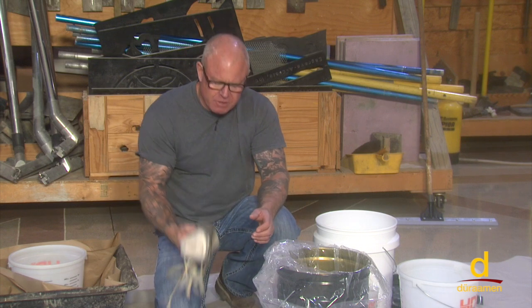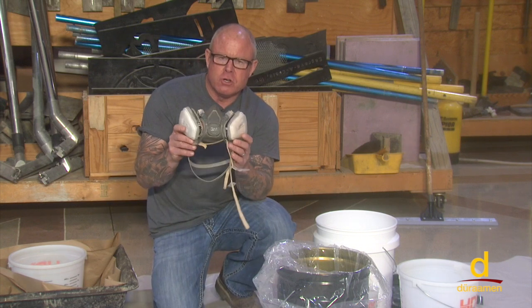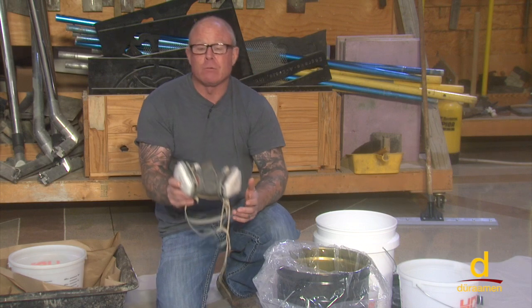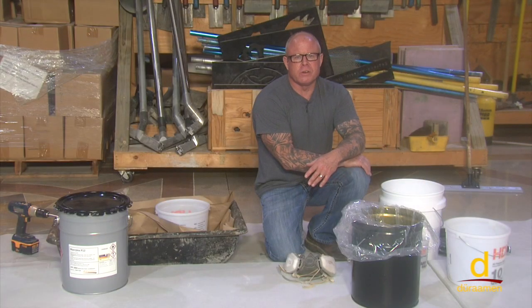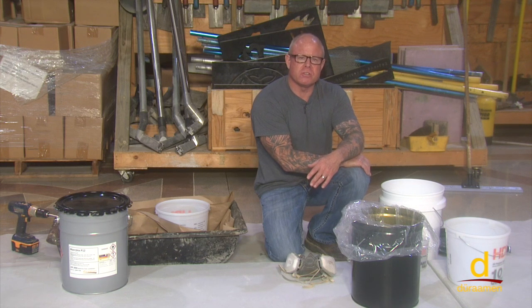Always protect yourself and wear the appropriate OSHA-approved respirator when working with these types of products. For exterior work or interior work in large open spaces such as a warehouse or large manufacturing processing area, negative air movement typically is not necessary to achieve proper cure, assuming the odor does not need to be vented. Smaller rooms will require setting up negative air with explosion-proof fans.